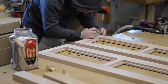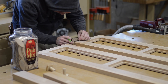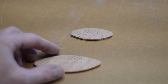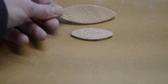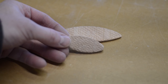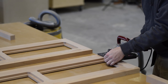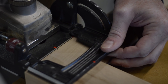Take a look at my jug of PubMix — it's filled not with PubMix but with biscuits, and those biscuits are gigantic. The smaller biscuit in this shot is a size 20, and the one I'm holding is a size S6. Just to be clear, the sizes of biscuits are 0, 10, 20, and S6 — which makes perfect sense. This larger biscuit is great when you want a little extra strength, though it does come with one drawback: you have to plunge the biscuit cutter twice.